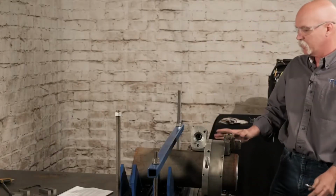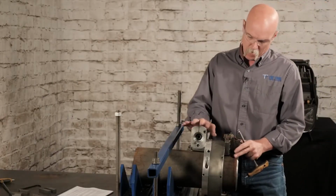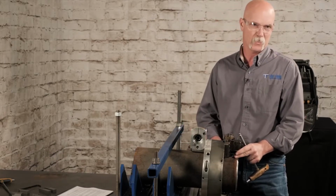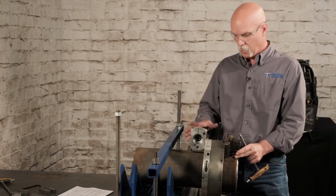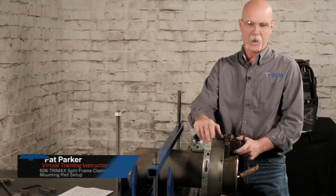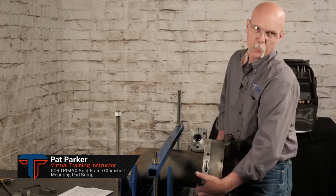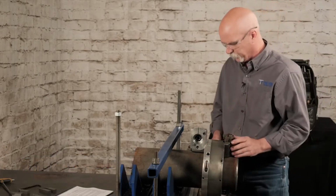So a feature of this machine, from our older version, is this has an internal tripping system. So the tripper pin that does the axial feed on the tool blocks is no longer on the outside of the machine, causing pinch points and hazards for your hands. There's 2 locations that you can put tripper pins on the back.